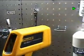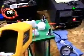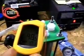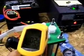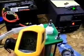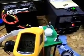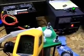We'll take that and put it on the outbound gas fitting on the gen, and you'll be able to actually see the temperature. So we'll go down here now, aim it, and put it on the temperature. Hopefully you'll be able to see that right now — this gen's been running close to 3 hours, and the temperature on the outbound gas is at 101 to 102 degrees Fahrenheit.